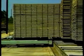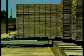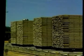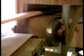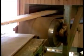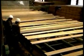When the desired moisture content is achieved, the stack is removed from the kiln and allowed to equalize or cool for about 24 hours. This rough dry material is then sent to the planer where it is surfaced to the finished size. The lumber now moves to the grading chain where highly trained graders determine the relative quality of each piece of lumber and identify it with a grade mark.